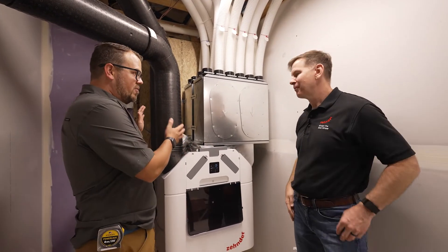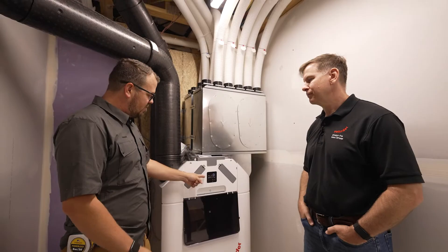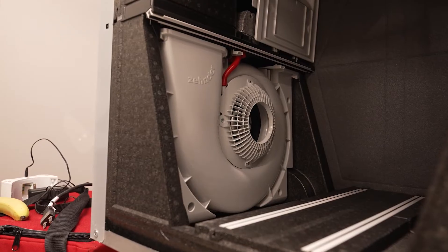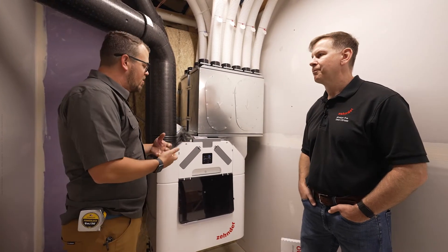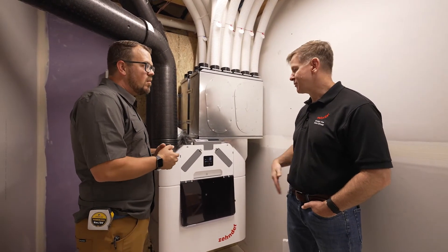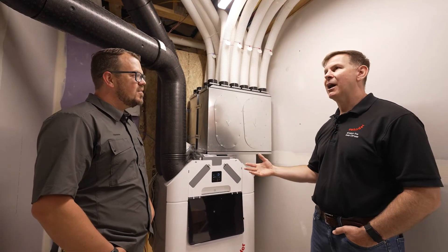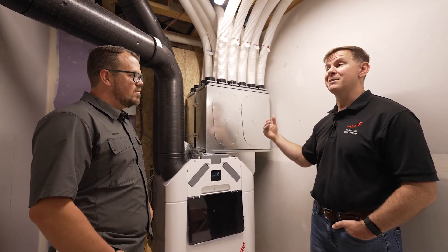This is an incredibly efficient unit — it doesn't cost very much over the course of a year to operate. We have essentially a small computer and two fans, running at constant low ventilation flow rates through a very efficiently designed core, so you don't have to push much air or run those fans very hard. Running at normal speed this thing is probably going to draw around 100 watts — the equivalent of maybe a big bath fan for the whole house.